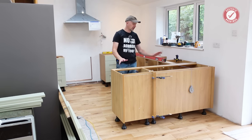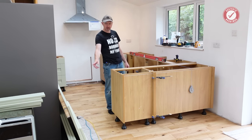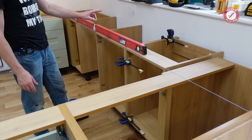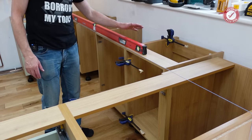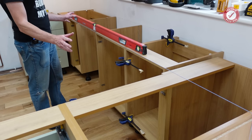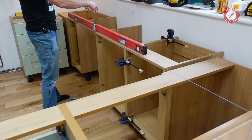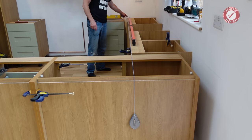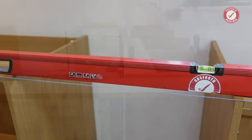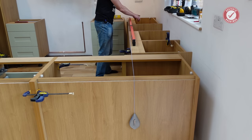A little bit further on now, and story so far — things are progressing well, although I'm sure we're missing an end panel. We did order three end panels and we only seem to have two, which is unusual. Anyway, everything is kind of dry fitted, most of the cutouts needed for utilities are done, units that can be clamped together are clamped together. One of the other things worth doing on a run like this where we've got a gap in the middle — we haven't really got a reference point. So what I've done is run a string line from the corner of this unit all the way up to the corner of this unit, because the walls aren't necessarily perfectly straight. That just allows us to get everything in a perfect line, so these units are perfectly aligned.